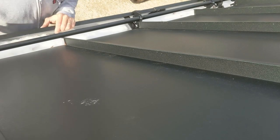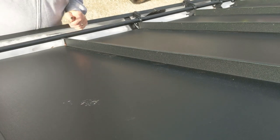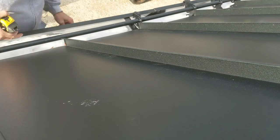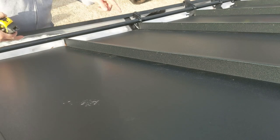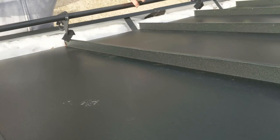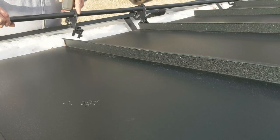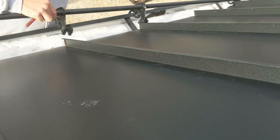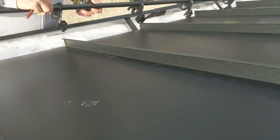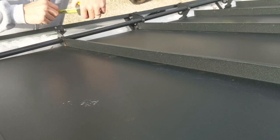A little windy here today but we'll get our message across. We're going to go just over this light here, so this seam here. The snow rail gets a clamp every seam. We're basically just lining them up where they're roughly going to go, and then we're going to measure up 20 inches.